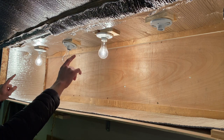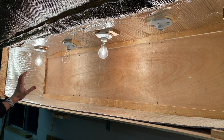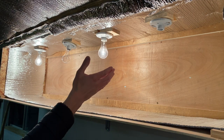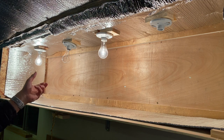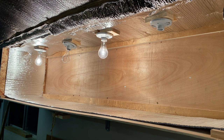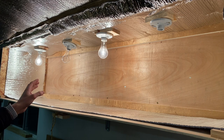I added four lights into the heat box — these are the sources of the heat. I have two 150 watt light bulbs and one 200 watt light bulb, and a place for an extra in case I need it just a little bit hotter. I can turn these on and off by unscrewing them to change the level of heat in the box. With two bulbs, I'm able to keep just about 140 to 150 degrees Fahrenheit, which seems to be pretty good. If I want a little more, I could add another 60 or 100 watt bulb.